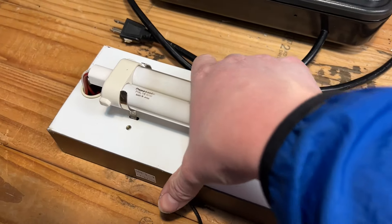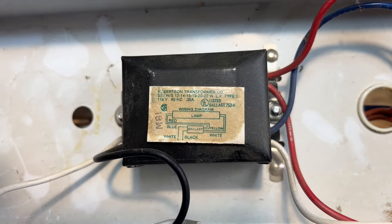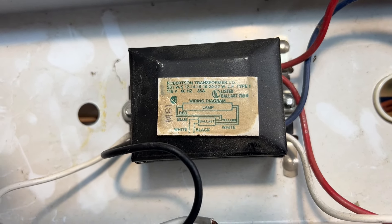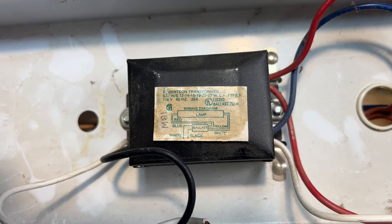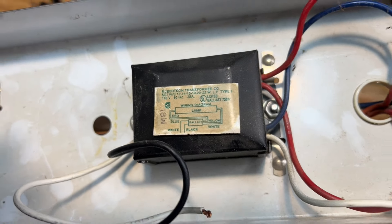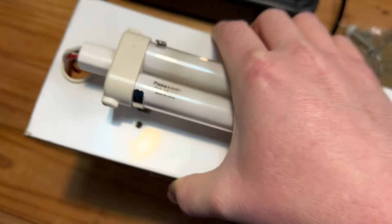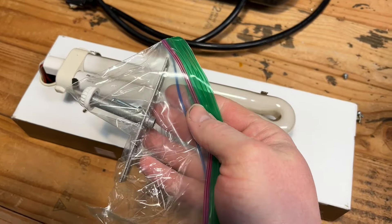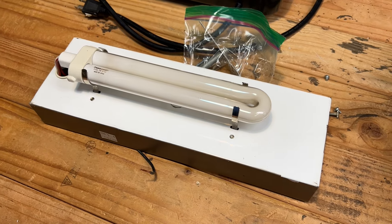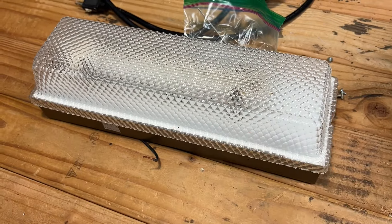What is ballasting this? Your standard ballast you would find for a Circuline bulb. In fact it does 12, 14, 15, 19, 20, and 22-watt bulbs. Pretty basic inside. The previous owner was nice enough to include the mounting hardware that was with it. That's a very cool find — a very interesting bulb design right before PL bulbs took over this particular style of fixture.